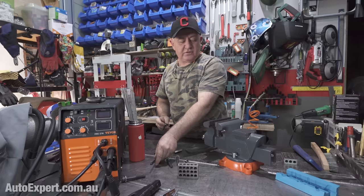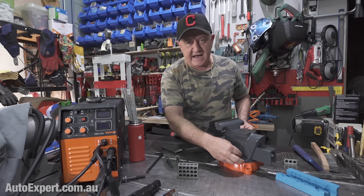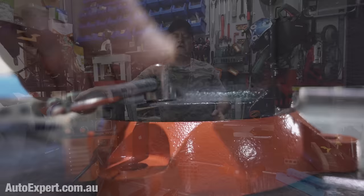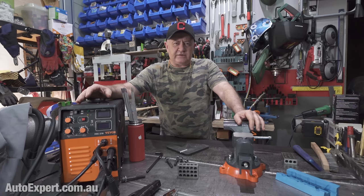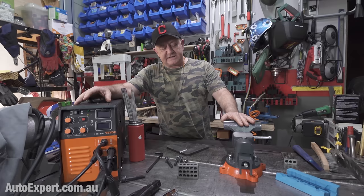You don't have to keep sliding the little lever one way or the other every half a turn. It's so easy to improve it with just two socket head cap screws. If you really do want to give a vice a good red-hot hiding frequently, don't buy a cast-iron vice at all — buy a fabricated steel vice, welded from steel plate, for real hardcore abuse, because that'll be much more tolerant. That said, if you're not going to give it a really big hit, cast iron is extremely good at absorbing vibration and being inert.